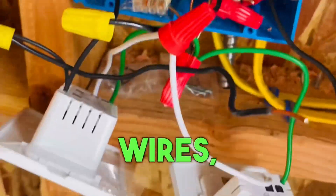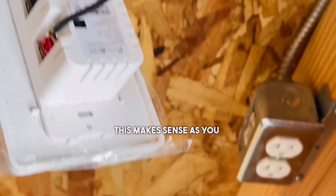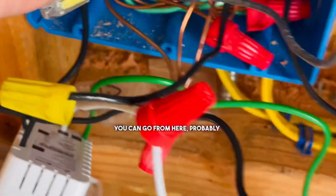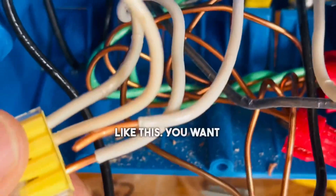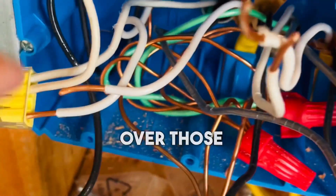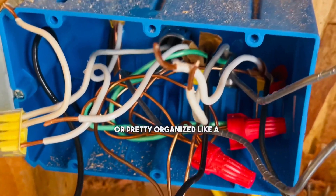I'm going to reorganize some of these wires, Phil — you just have too many. Like you have a tail going to a tail going to a tail going to a tail. You have too many whites in here. You can go from here, probably do another connector there, and push all these to the very back. When you do this, you don't want to crisscross all these wires. You want all the wires coming in neatly — organized like a circuit board.